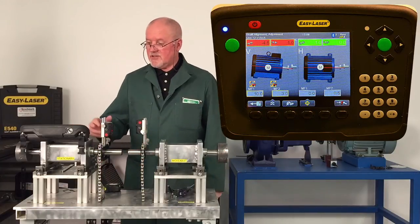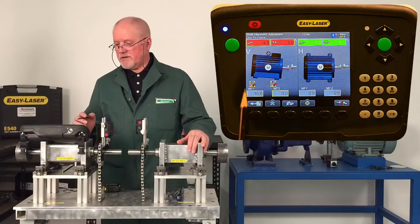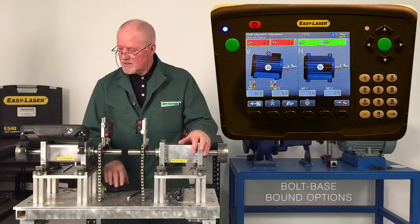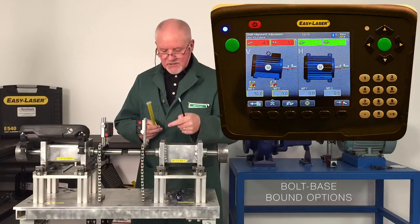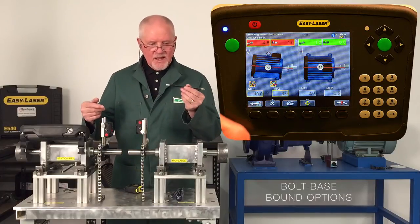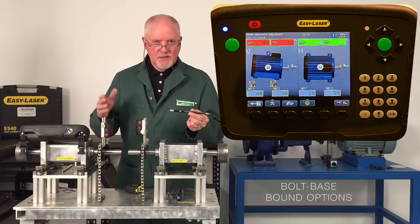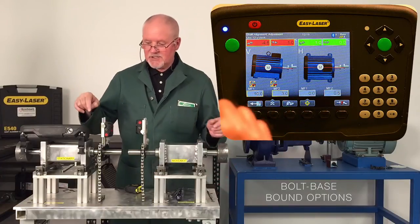To exit, I press that button and you can see it has changed — it's actually asking for 10 and 3. During the analysis you can see both are in the red, meaning they're out of spec, and as I said, it's basebound — I can't go down. I have to look at what else I can do. When you measure, you measure from a reference. Right now I'm measuring this shaft in relation to this shaft — this is my reference and I move this shaft to be in line with it. Since I can't go down, I can change the reference point — meaning I can adjust the stationary machine — and the only place I can make corrections is at the machine's feet.